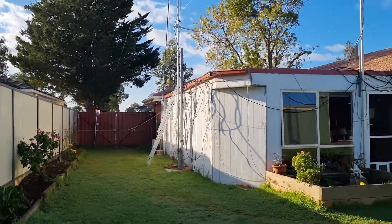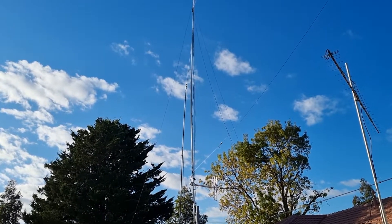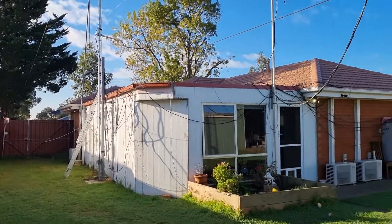So this is it - a very simple antenna, 43.7 meters long, snaked down the side of my house. To give you an idea of performance on 40 meters, I've worked about 240 countries - probably about 140 of them in SSB, around 40 to 50 in CW, and a lot in FT8 as well.